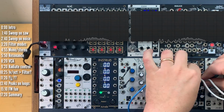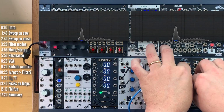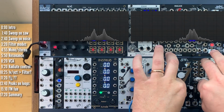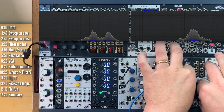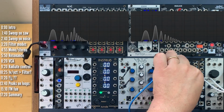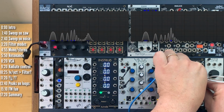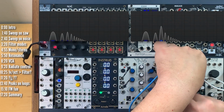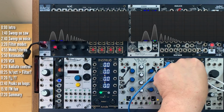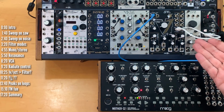And smile pass is like a notch filter, but as you crank up the resonance or the peaks, it basically doesn't filter out anything, but does let the peaks through. Let's hear this tone, right? You can see all the harmonics are there. The peaks are just added to them. Now, this is a really, really neat and unique feature. The filters don't filter anymore, you just have four peaks that you can use to enhance various frequencies. Makenoise call this a smile filter because you get up to four peak resonances and get to keep all the harmonic content, hence the happy smile.